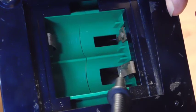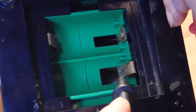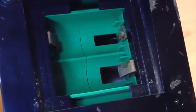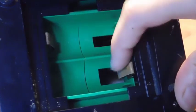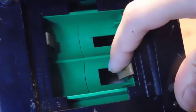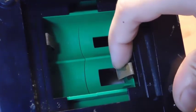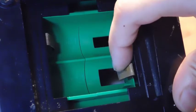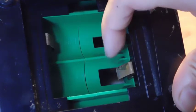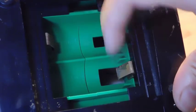I think the only reason this thing isn't turning on is that these terminals have lost their plating and they're all corroded, probably from battery acid. What I'm going to do today is take these apart, start by sanding them down and polishing them using a mix of sandpaper and Brasso — the dreaded Brasso that you don't want to use on your cartridges. I'm going to polish these up and clean them, and then after that we're going to do some electroplating and see if we can restore them back to their original condition.